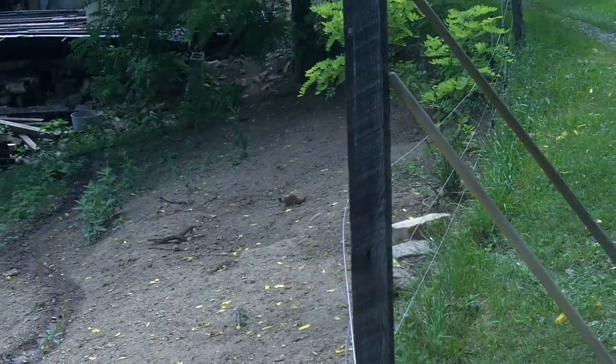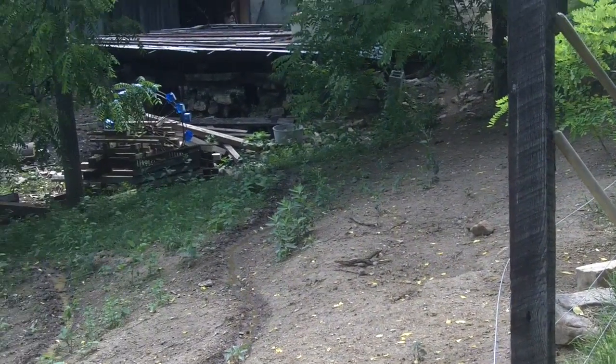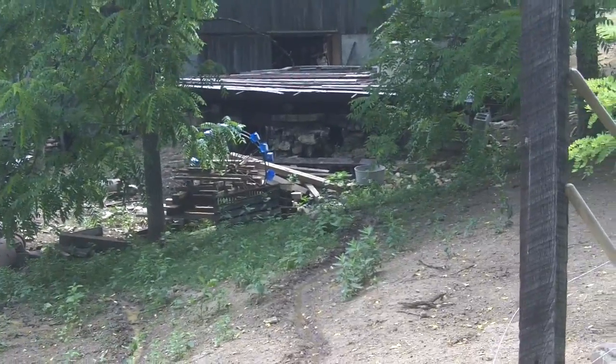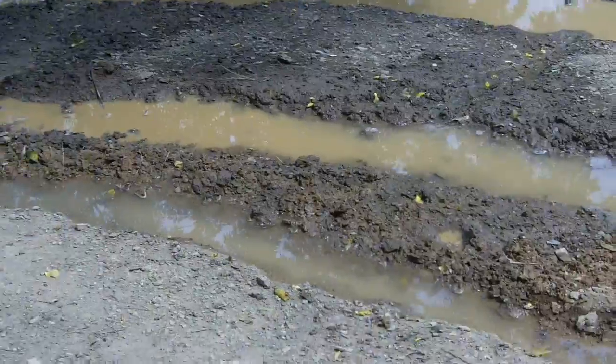And I'm hoping to make it, I might have said this before, above that walnut right there. That walnut's out about 20 feet. If I can't, well, that'll still be the right height, because then I'll have the maximum head to go down over the water wheel. It'll be a pitchback water wheel, and I've discussed that elsewhere. But as it is, if I just open this and let the water go, the water will run all the way to the wheel, but it would have no head to mount to anything. It would have no height, so no power. I'll say more about the wheel later.